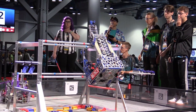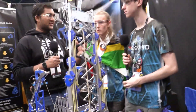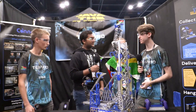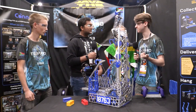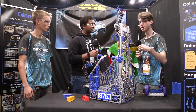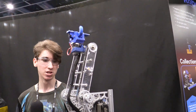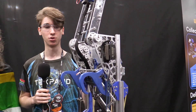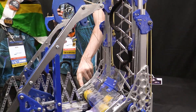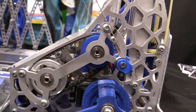Were you looking at current draw when optimizing, or was it cycle times driving your decisions? One of the main things was our spike marks in auto - the speed of those. We went from almost 8 seconds down to about 6.5 seconds just from optimizing the slide height of our transfer and the speed of our slides. We got an extra 100 milliseconds per deposit just by redoing the counter spring and changing the pulley size - we used to run 24-to-24, but now we're doing 24-to-18, which really sped it up.